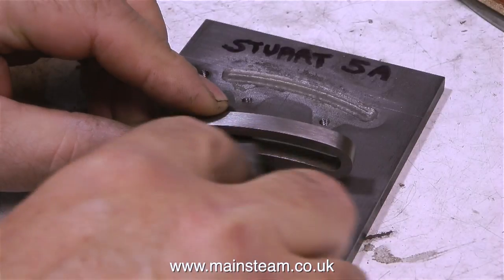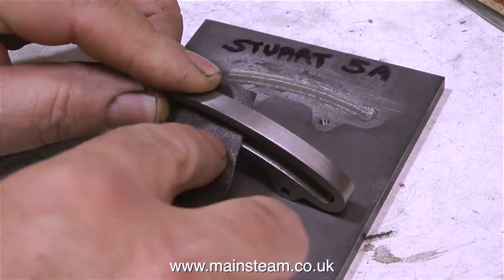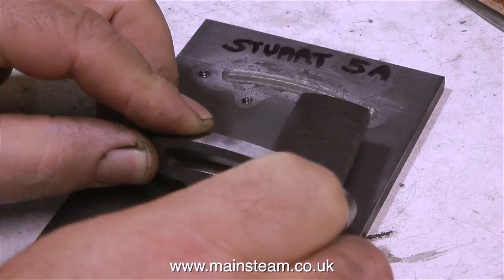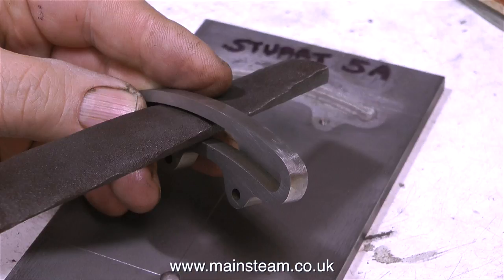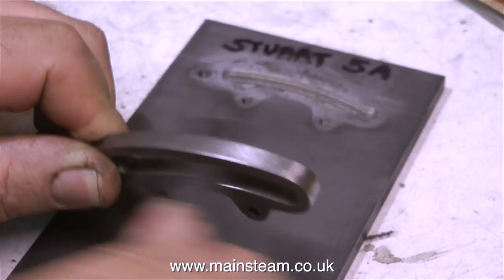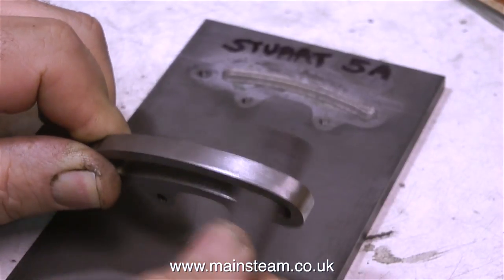In the last episode I made this - this is the expansion link. At the moment I'm quite busy with some very fine emery cloth and I'm cleaning up the slot. In the last episode the final clips of the cutting of the groove with the milling cutter I ran in real time, and you can see how slow I was going. So really I don't need to do much cleaning up at all - I just want to make it very smooth so that it slides on the die block without binding anywhere.